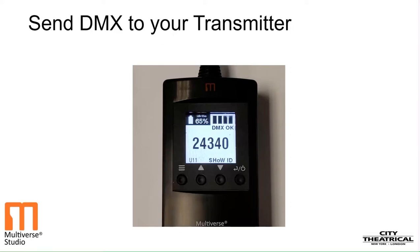Let's look at a few ways to judge the system's performance. In some ways, you can improve it. The signal quality bars on the user interface tell us a lot. There are 4 bars. 3 or 4 bars means excellent quality. 2 bars are acceptable, and 1 bar is marginal. Signal quality can also be checked by using RDM on the DMXcat app.